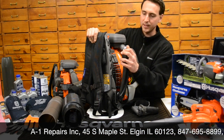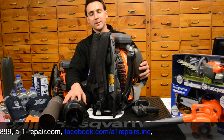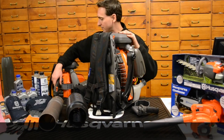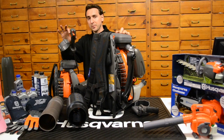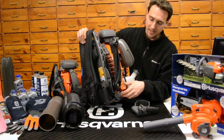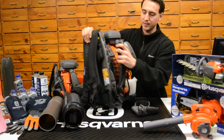The reason commercial guys tend to favor the left-handed throttle design is that a lot of times customers or commercial cutters accidentally leave their blower in front of trailer tires or leave it on an open trailer bed. If a zero turn or car tires roll over it with the right-handed throttle design, not only do you wreck your blower tubes, you also ruin your throttle mechanism — which gets pricey to replace. You'll also notice the throttle cable is a lot shorter, so you don't have to worry about catching it on things.